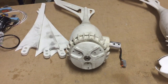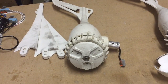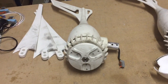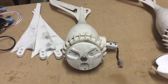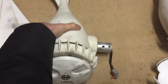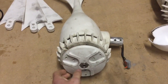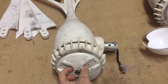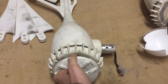We set the first one up on the beach during winter season, so it was quite windy. It was working for three months, then it stopped. We took it back to the workshop, opened it up, and the problem was in the bearing. We put a drop of WD-40 on it and it started moving again.